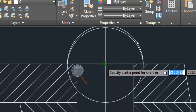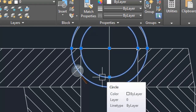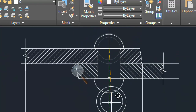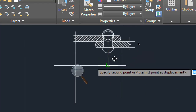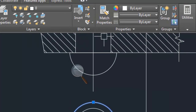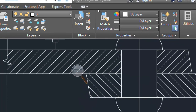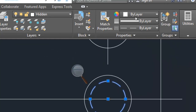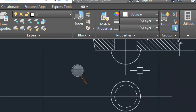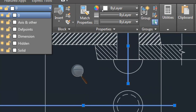And draw one more circle with the same point. Now these two I will have to move them here. Now this bigger circle is solid because it is visible. Whereas the inner one — is it visible? Not visible. So we have to change it to dashed. And what about this line? That is the axis line.